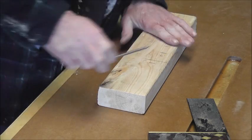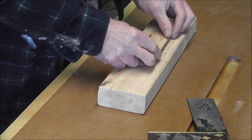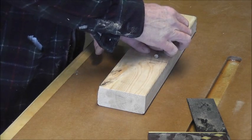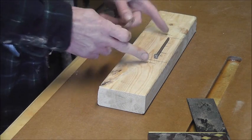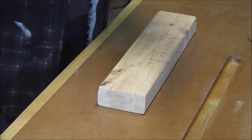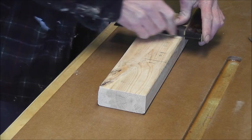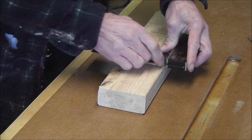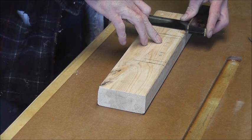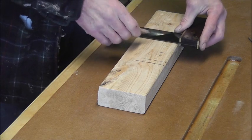Right, you start off with a stock piece of wood, take the nail that you're going to use, and just roughly make the sizes of it, mark them onto the piece of wood. And then what we want to do is end up with four teeth. Once you've got them points, start at the beginning and at the end. And then we want the other two teeth. Now keep them roughly about half inch thick, each tooth.